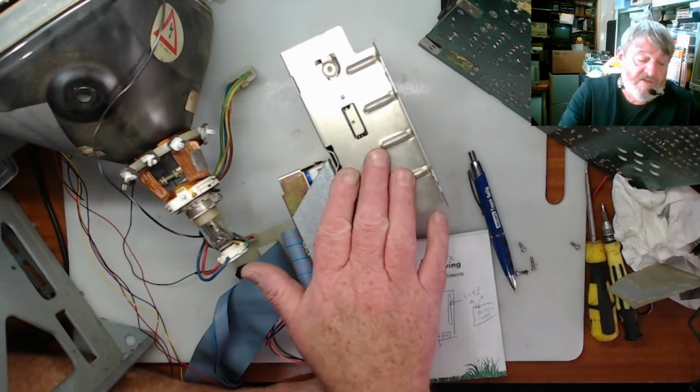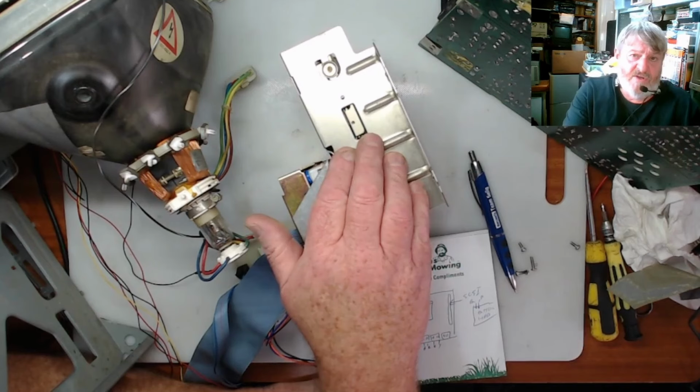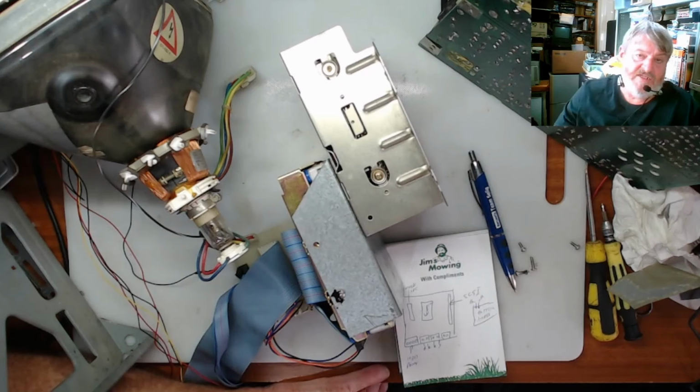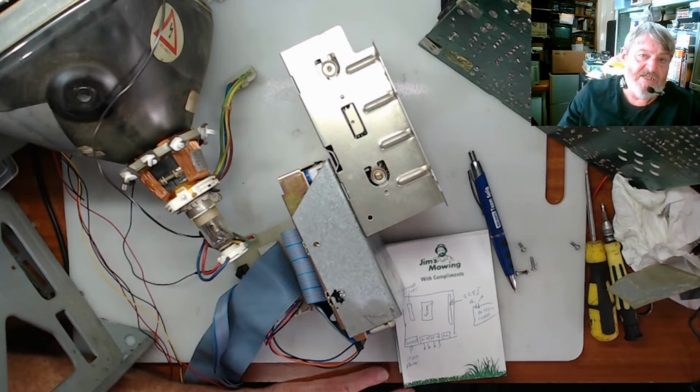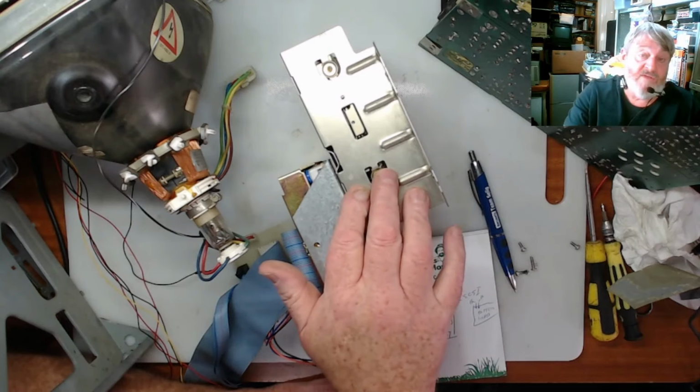A big problem with a lot of these classics was in the floppy drive, they ran a Sony floppy disk drive, 800. Some of them ran the 1.44s. It was in the eject mechanism. There was a gear they made for them, and it tended to be a different colour to all the other gears. That used to go brittle over time and would strip out. So the drive, you'd put it in, but it wouldn't eject, and you could not eject the disc. Sometimes they would partially eject and then strip, and if that happens, the whole timing goes out, and you'll never get another disc in. It is relatively easy to fix if that is the problem, but we'll go through that when we have a look at this later on.